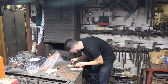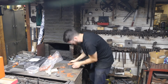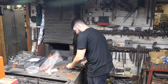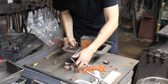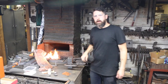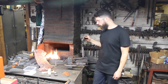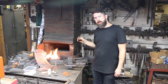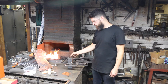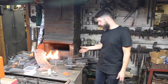Alright, let me try that. The brass is getting pretty close. When you pour you want to pour fast but even. Then you basically just pour until the brass starts filling up in the sprue area here, and either it went all the way or it didn't — hopefully it does.